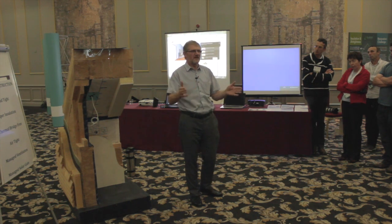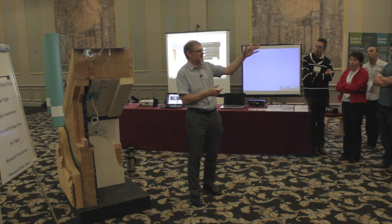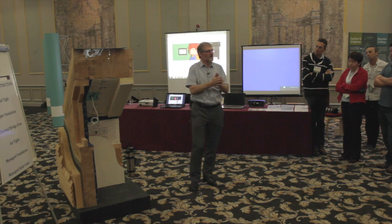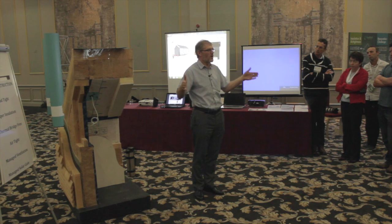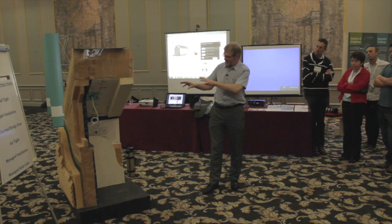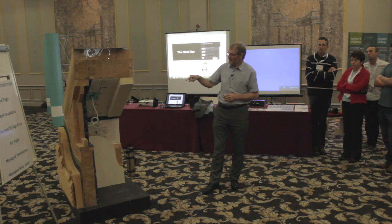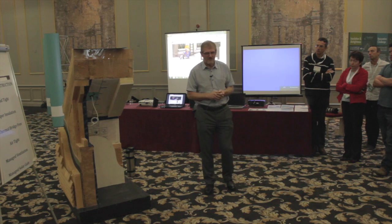Traditionally it's plastering on the outside, plastering on the inside — three or maybe four layers of construction. But if you look at this model there are seven or eight layers involved. We've gone into more detail, put more and more on, and you might think, oh that's brilliant, no thermal bridges now. But actually there might be. So although we might be doing something great, it could still cause us a problem as we go along.